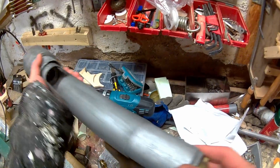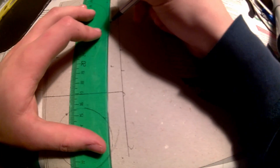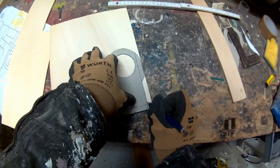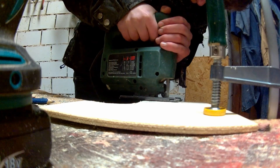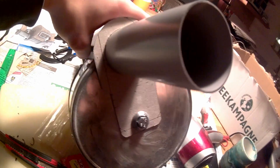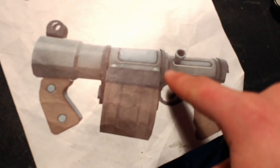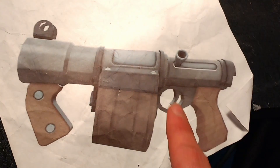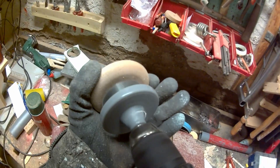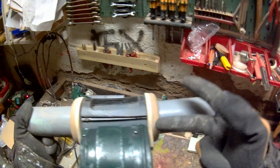When I was done with that I worked on the two connection pieces between the magazine and the barrels. Since I had my life-sized blueprints they were fairly easy to make — I made paper templates of the two parts, transferred the shape to some thin plywood, cut them out, and sanded them. The magazine is held in place using a long bolt with a suitable nut. Next I made the round connection piece which is a transition between the ejection chute area and the thinner rear barrel part, using different-sized hole saws, sandpaper, and a power drill misused as a kind of lathe.